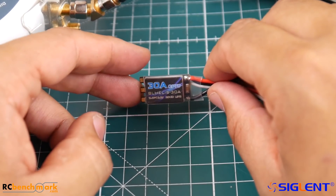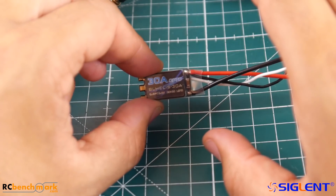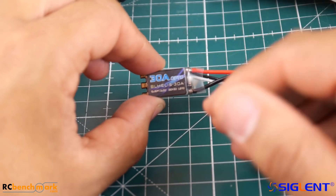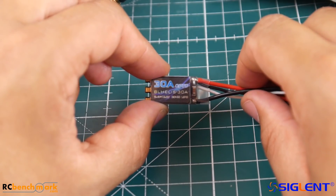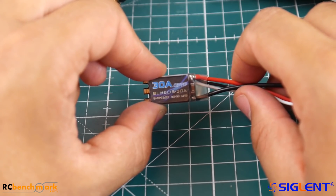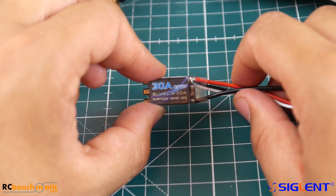Here's what we're going to do today: first we'll set this up, then check for noise. We'll record the FPV video feed with a flight controller that has no regulator on board for the VTX, to see how it would really affect your quad and your FPV footage. Then we'll stick it on a DAL RC F405 all-in-one flight controller and see the difference in the FPV video feed. The 9-volt regulator on the DAL RC all-in-one flight controller is just insane.